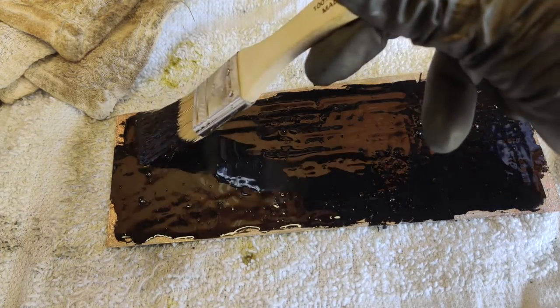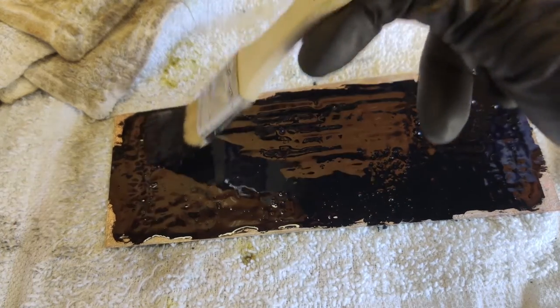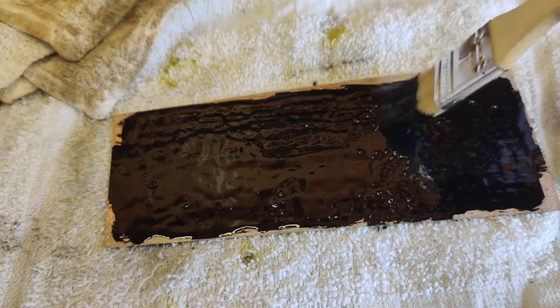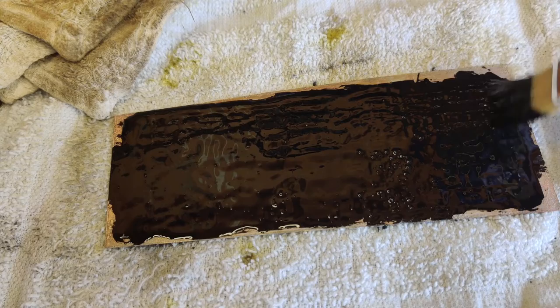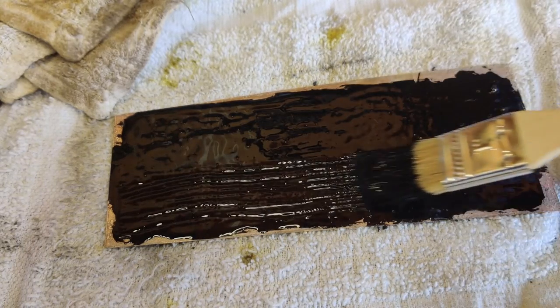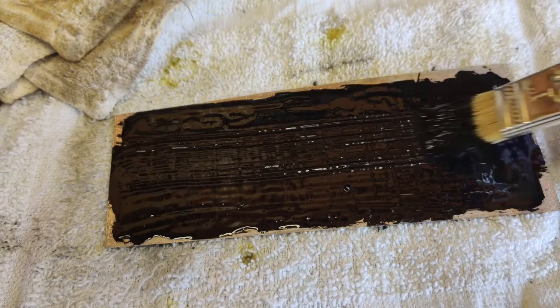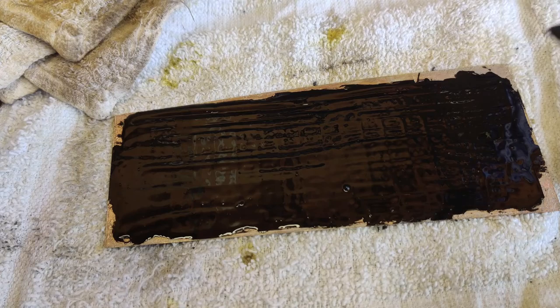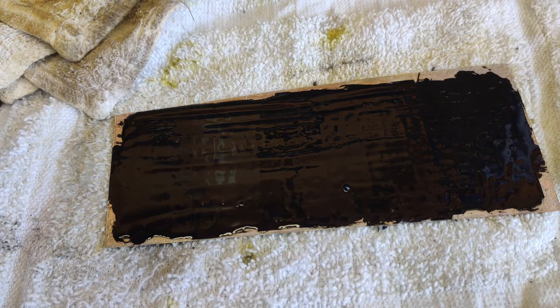This paint, as it gets exposed to the air, cures and hardens like an epoxy — but this is just an enamel. Once this is cured over a couple days, we're going to come at this with a light sandpaper on a flat plate. I would use a surface plate if I had a cheap one to sacrifice for this, but I'm going to have to settle for using a thick sheet of plate glass, which is going to be about as flat a surface as I can really use for this at this time. We'll go at it with a very, very fine grit sandpaper and gently go back and forth until we've gotten all of the high points brushed down. That will give us that nice contrast between the filled recessed areas and the shiny brass high letters and borders.